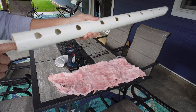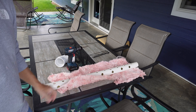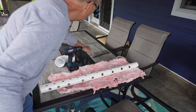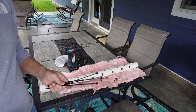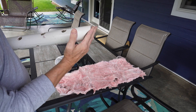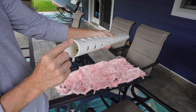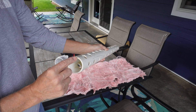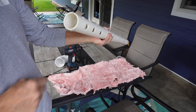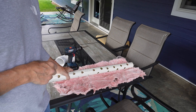The air will come out the same way through this 2-inch pipe, and it's only going to be 38 inches. All we're going to do is wrap this with fiberglass insulation. I'm going to use some zip ties and just tie it on around it. The other important thing is where this angle is - I want to make sure I know which side is the top. Out on the other end, which would be out on the side of the house, I made a little black mark so if I have to twist it back and forth to get it in there, I'll know where straight up is on this pipe. Let's go ahead and wrap this and get it on.